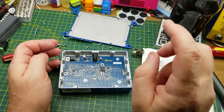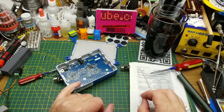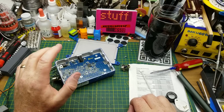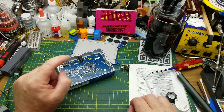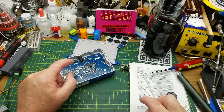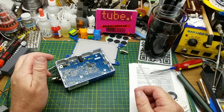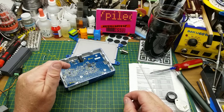There aren't any real surprises in this thing other than how basic it is — how little there is inside it for what it's doing. That still doesn't change my disdain for this general class of device. If you have a cellular booster or think you need one, please have it installed properly by someone who knows what they're doing. Make sure the indoor and outdoor antennas are as far physically apart as possible, with as many walls and impediments between them as possible, and that the outdoor antenna is directional, pointed towards the cell tower and away from the indoor antenna.